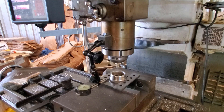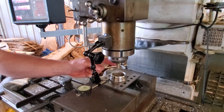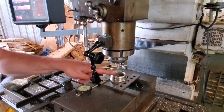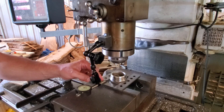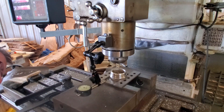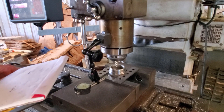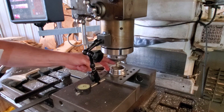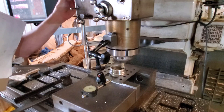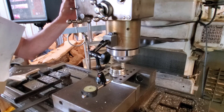Now here's one case where getting close matters. I may want to offset the head because I can use a diameter of 2.347 — offset the head so that the side of the cutter is at that amount. At 90 degrees, I'll center up manually before I start using the indicator, which is a tenths indicator. If I do the math, with a spindle offset of 0.9235, that puts the outside of the cutter flush with the outside of this diameter.